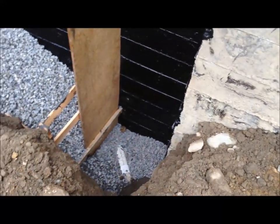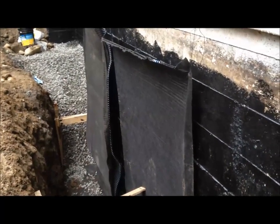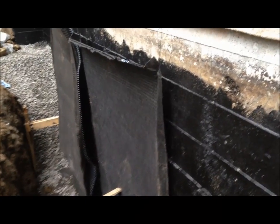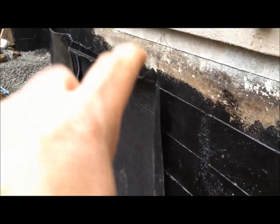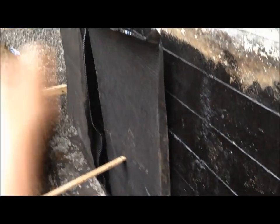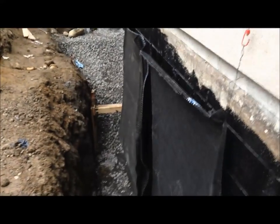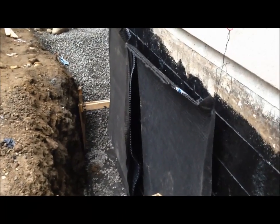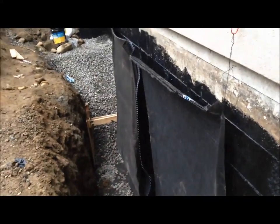The start of video five will be the addition of a top layer of sand that will go right across the top. We'll compact that down and then rebuild the pavers in their original place. So this is a rubber or plastic membrane covered in landscape fabric. What professionals do now is they hang this on the side of the house - you can see it hanging, there's two pieces. There's two parts to it, and you can see the shiny edge going down the middle. The rubber membrane is dimpled - there's lots of little dimples coming out. It's like somebody pressed their fingers in from the back into the hot rubber.